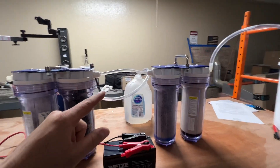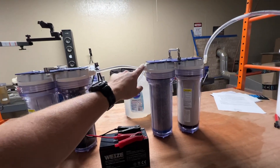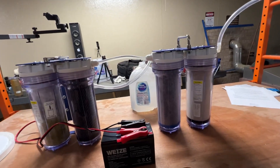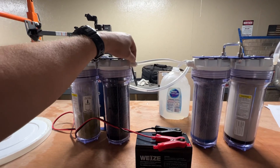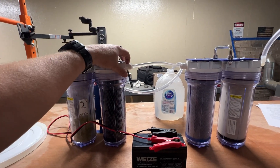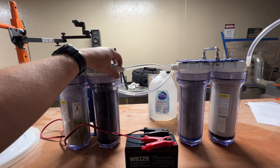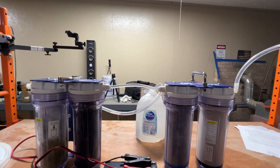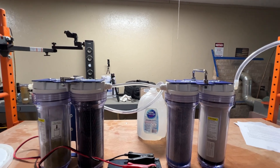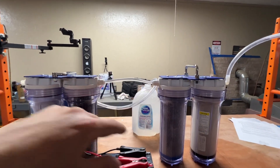I was just getting this set up and had a little bit of trouble — really my fault, not theirs. These little quick-connects came installed and I didn't check to see if they had Teflon tape on them. They didn't, so I went ahead and added some Teflon tape and I think we're good to go now. I had a little leak earlier, but that should fix it.